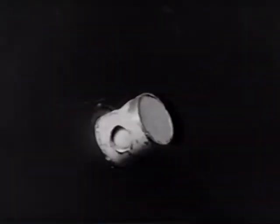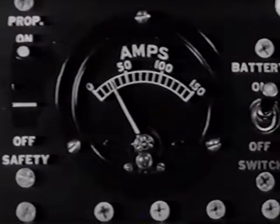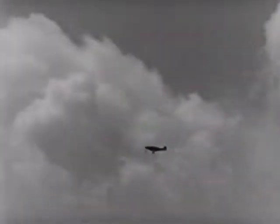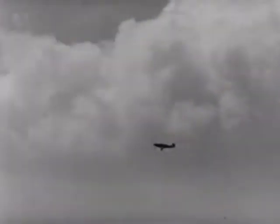When the wheels are fully extended, the pop-up indicator on the nose cowling and one in each wing panel will be visible. The travel indicator will be down and the ammeter should read normal. In making your approach, you will find that with the P-39's excellent visibility in all directions, you will not have to make a close turn to keep track of other traffic in the air. You can come straight in if you want to.